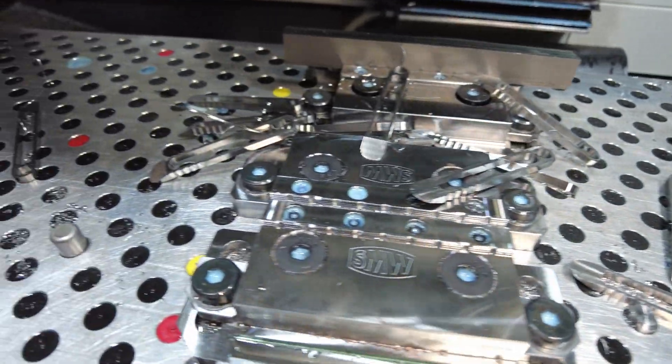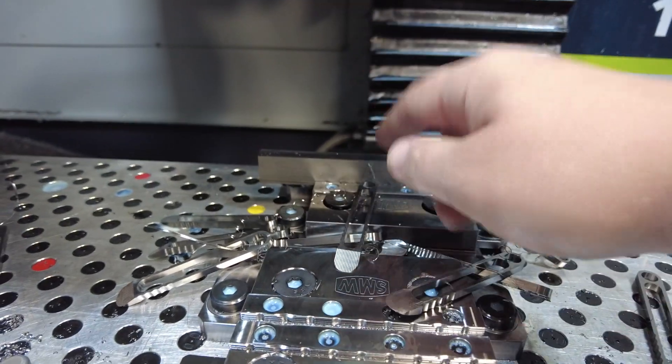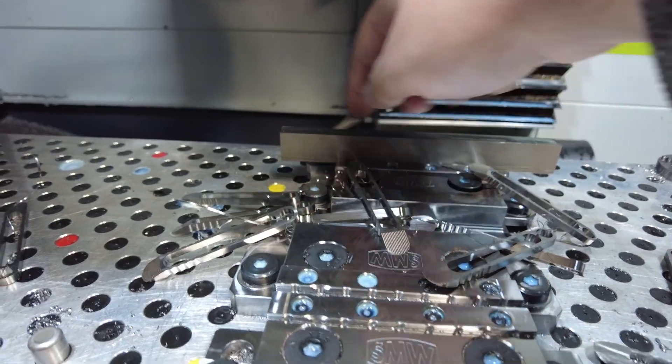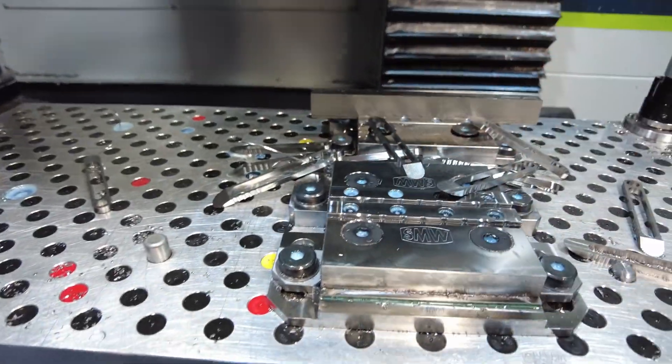Here's the aftermath from that first production run — it went off without any problems. The only thing is I thought I patterned it down 10 times in CAM but I only did nine times, and there's actually enough material here to get two more pry bars, so I'll quickly run those before going on to the next batch. I'm really happy with how this worked out. At this point I only need 40 pry bars plus some inventory for my Etsy page, so I'm going to run this basically for the rest of the day off camera, because at this point I think I've gotten the point across. I really love this salami slice method — it's such a great way to get a lot of parts without a lot of human interaction. In the future I'm going to do my best to design my products to use this method because it's so efficient. If you want to buy something we make, you can find it at designtheeverything.com. Thanks for watching and I'll see you next time.